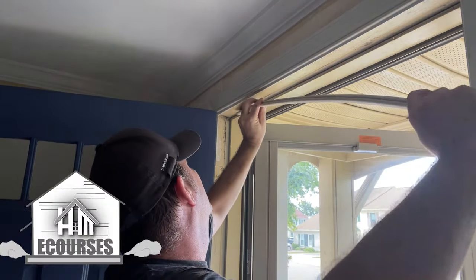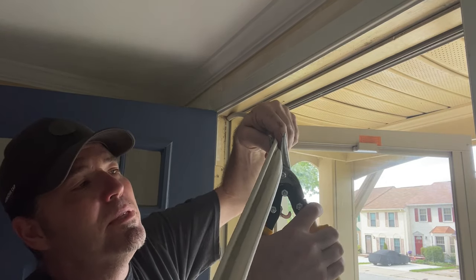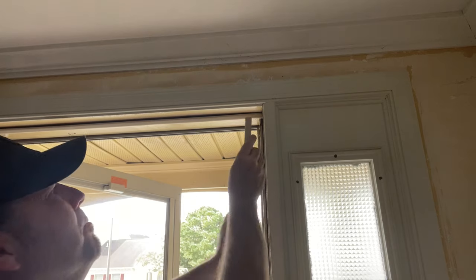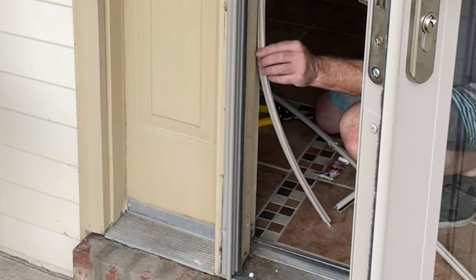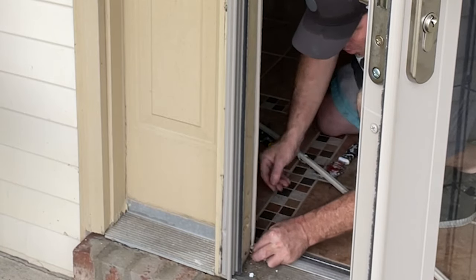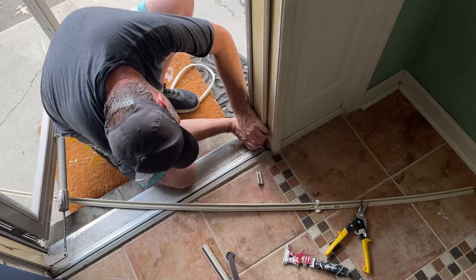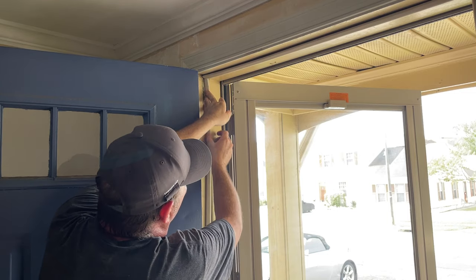Let's run our top first. I'm just gonna put it all the way to the jamb, go all the way to the other side and snip it with your snips. Now this fin side lays flat on the jamb and you can slide that fin barb inside the track — fin side in — and you can even stick that side in to hold it while you mark it. Walk it down, go ahead and feed it into the slot, then fold it into the threshold all the way down, mark it, and cut it with your snips.